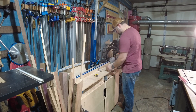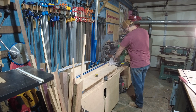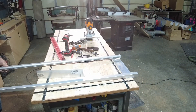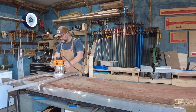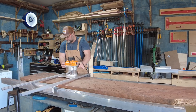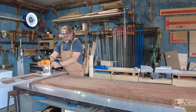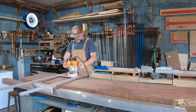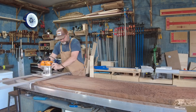I cut down the four-foot long piece of angle stock to two 14-inch pieces for my rail guides. I bolt the rail guides to the square tubing on each side, then rivet the wheels to the rail guides so it can slide up and down. Now you can see it at work — it works pretty well, making for a smooth operation when flattening these slabs. I like it because it's very simple to move left to right, which is cutting with the grain from what I can tell.